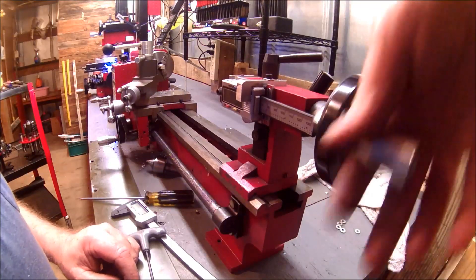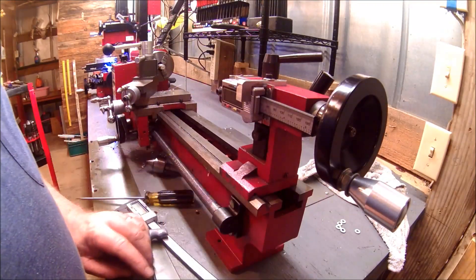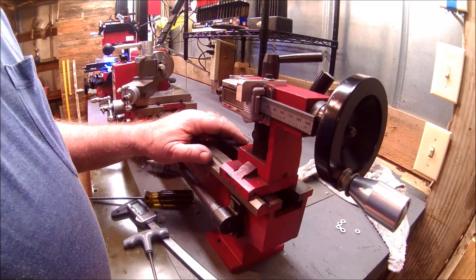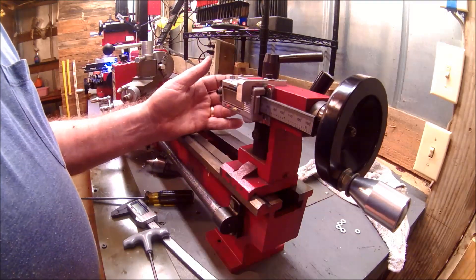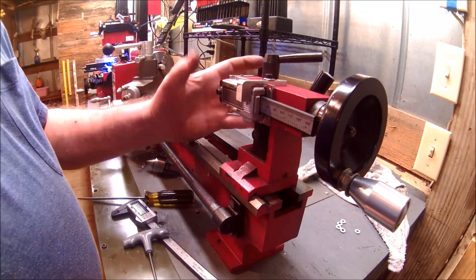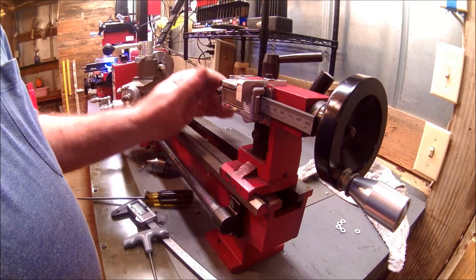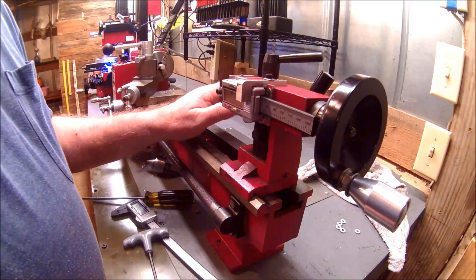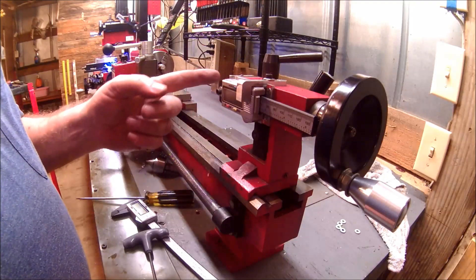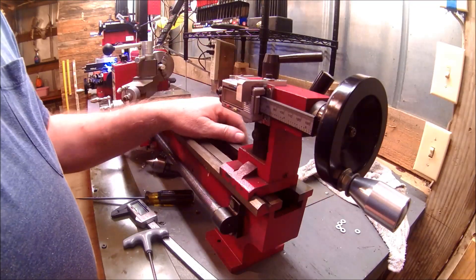So far this has been the best solution I've been able to find for mounting the caliper as a DRO on the tailstock. This has worked for several months now without any problems, whereas mounting on the top or trying to hang off the side - even with double-sided sticky tape - just simply wouldn't work after a period of time: oil and cutting fluid would get on it and the sticky tape wouldn't hold either. The little plastic caliper is much easier to grind and form than the stainless steel ones. Hope this helps.